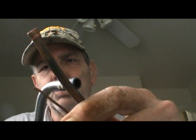The air comes in through the ports here and mixes with the acetylene and then swirls out the tip around the tube. It swirls all the way around this copper, and when it flows the solder, it just goes all the way around. Boom, you're off of it. You don't have to sit there and turn it and go around. With the flux on it, it pulls it all the way around. You're off. It's that quick.